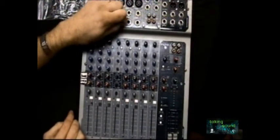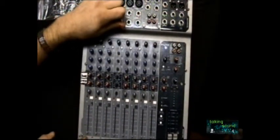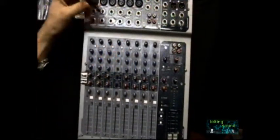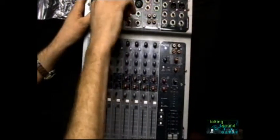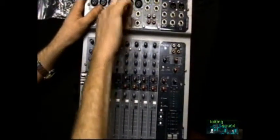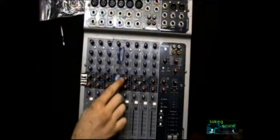Pop that out, come down to the second input, and do the exact same thing. Give it a good 15 to 20 turns. I normally do most of my cleaning in a very OCD manner — turns and insertions are done in increments of 25. Once we've done that we give it another quick spritz to get any excess dirt off, and then insert and remove it a good 20 times in each hole. What you're doing there is making sure that everything the input makes contact with as it goes in and out is being cleaned off.